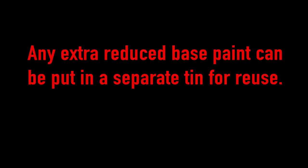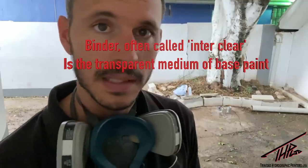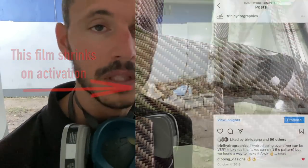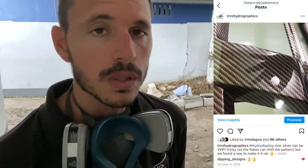I'm going to go ahead and clean out my spray gun. Tomorrow we will get to hydrodipping those parts. With metallic paints, I usually let them sit overnight. If you're using paints with a lot of silver in it, I definitely recommend spraying them over with binder. Binder is a colorless base paint that seals the metallics, because when you hydrodip stuff that has a lot of silvers in it — especially on certain films that shrink rather than expand — you get a lot of concentrated activator that causes the metallics to shift. By spraying them over with binder you get excellent results and you don't even have to leave it overnight — just about two hours or so.